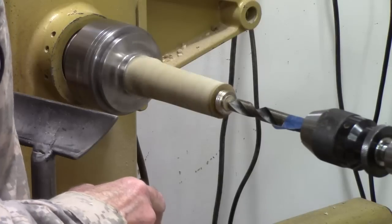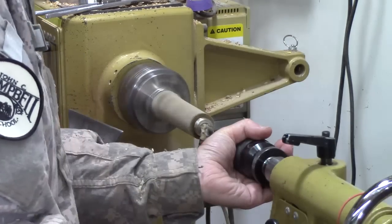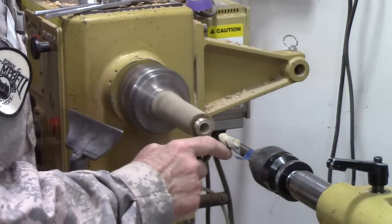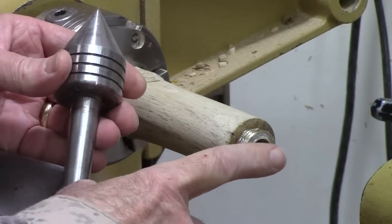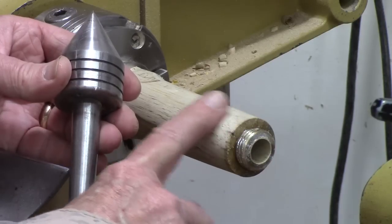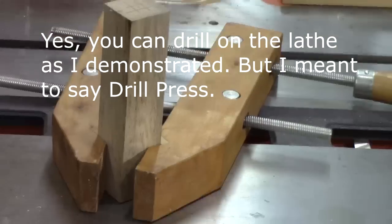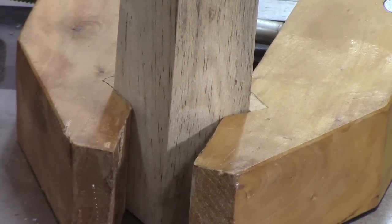You're going to drill fairly slow — no more than 500 RPM. When you start making noises, clear the chips because that means you're beginning to jam up. I'm going to finish turning the shape of this. If you want to drill on the drill press instead of the lathe, here's a clip that shows you a really easy way to hold your blank. I prefer to drill on the lathe because I think it's easier to get it centered. You can drill these screwdriver blanks and other tool blanks on the lathe — a hand clamp works real well if you make a 90-degree cut in the opposing jaws to hold it, about a half inch on each corner.